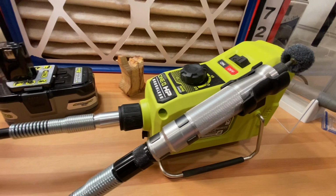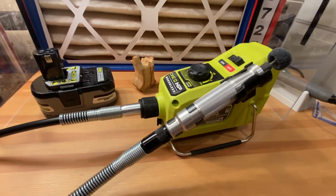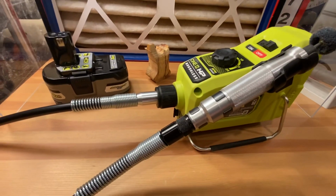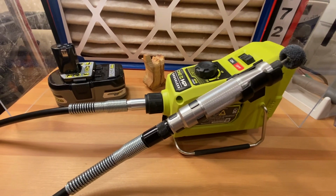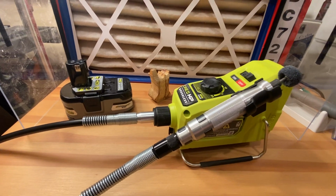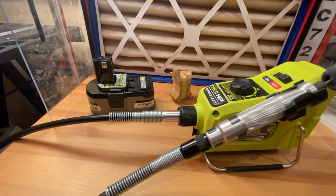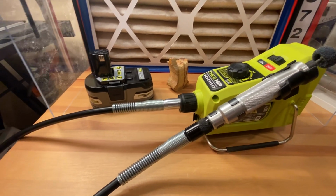The only thing, like the too long didn't watch, I guess, upfront summary of this is I like everything about this, but now that I have my Oz Elite micromotor, the one thing that I can say is that the 25,000 RPM is a little bit of a handicap if you're using double cut carbide burrs, because even at 35,000 they start to shine, but with this guy, when I put it on 40 or 50, those double cut carbide burrs really come into their own. They'll just easily cruise through any wood that I throw at them.